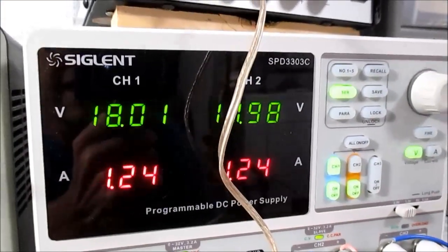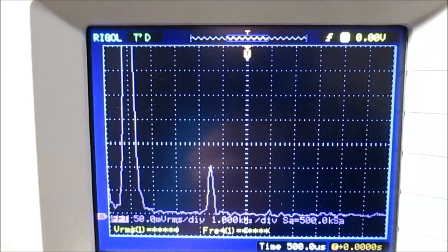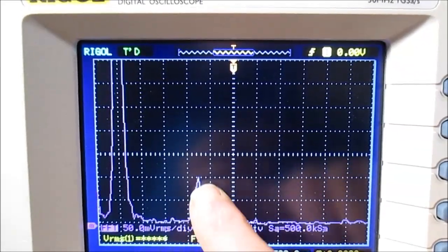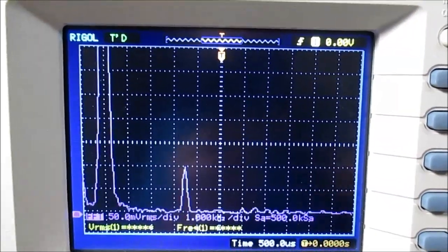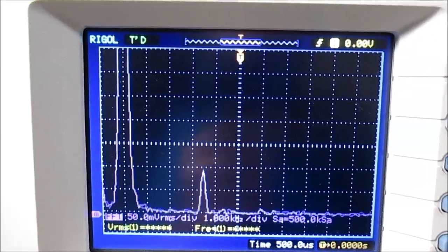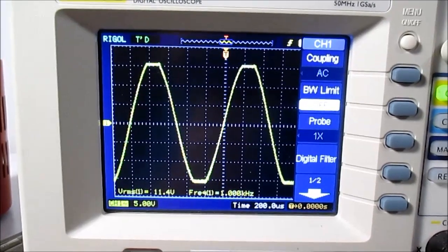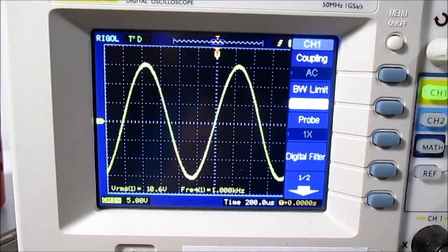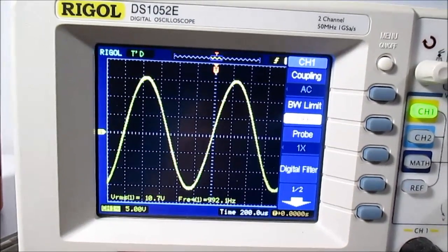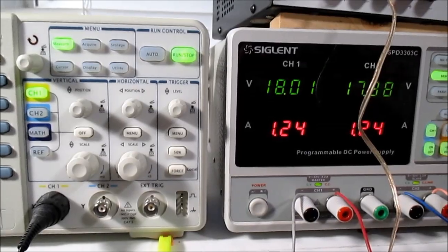Running the supply at 18 volts — 36 volts total, plus and minus 18. This is clipping; we'll tune out the harmonics. That's the 1% pilot signal and the 1kHz fundamental — no distortion at all as far as this scope can see, so this is excellent performance. With a 4 ohm non-inductive load resistor, taking measurements just before clipping, running about 10.7 volts RMS, that would be a little over 25 watts — probably around 28 watts or so. I'll come back with all the results.